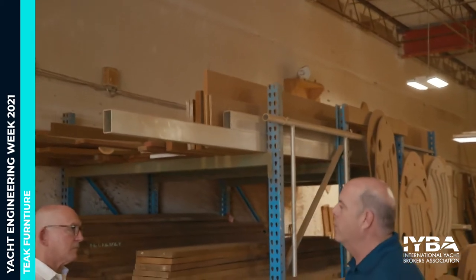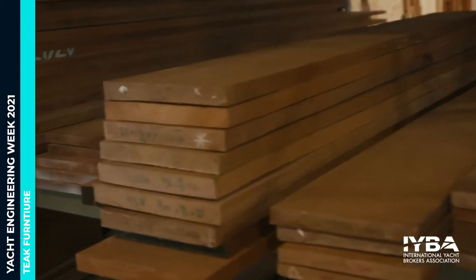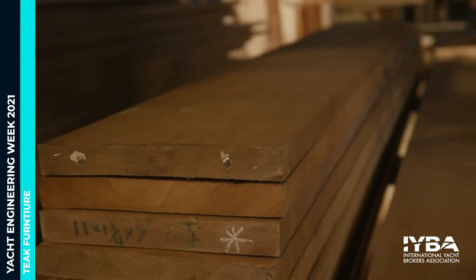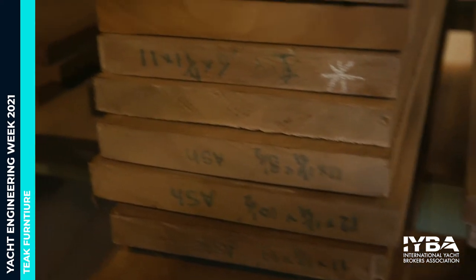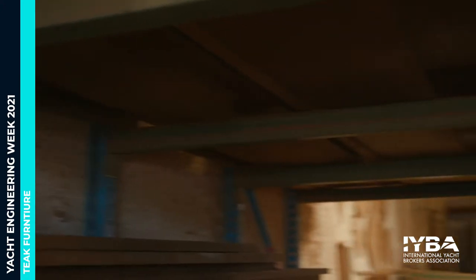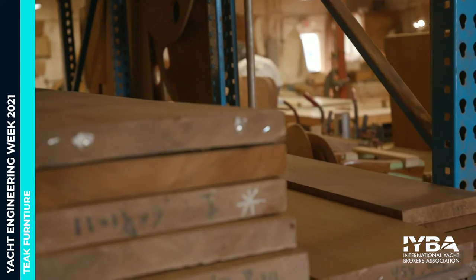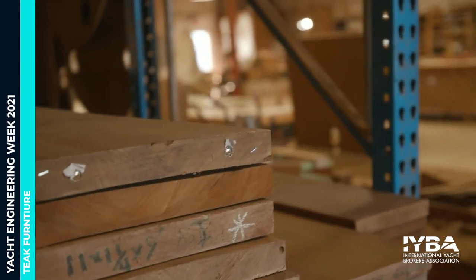For different areas of the chair, table, or whatever it is, we'll be using different thicknesses of wood. Everything with wood is measured by quarters — you don't have an inch and a half, you have six-quarter. Just like you have four-quarter, five-quarter, six-quarter, on up to twelve-quarter. Is it becoming more difficult to source good, straight-grain, thick, wide planks of teak? That's exactly it. All of those terms together make it a challenge. Good, thick, straight grain — they all contribute to the scarcity of the wood. You can get one piece that might be good coloring but poor graining. That typically comes from old-growth teak as opposed to plantation teak, which we see a lot of in boats these days — it has a greener hue and is mostly veneers rather than thick pieces.